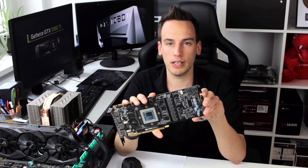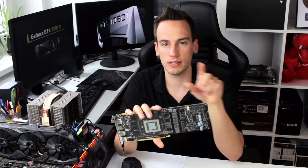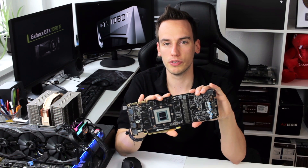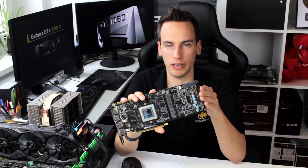Even with 120% and 300 watts power consumption, this is still not enough - if you analyze the frequency over time in a benchmark, the frequency is still not stable and you're still limited by the power consumption if you check it in GPU-Z. That's why we will do the power mod and see what the real benefits are.